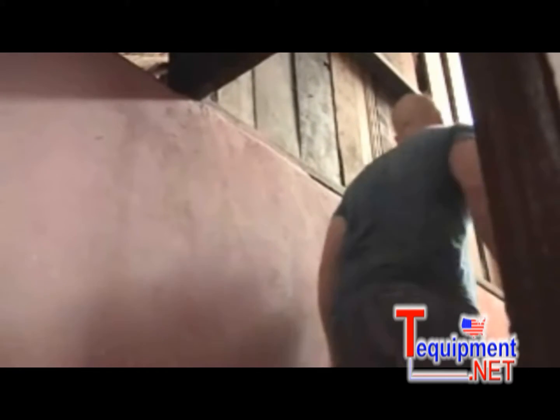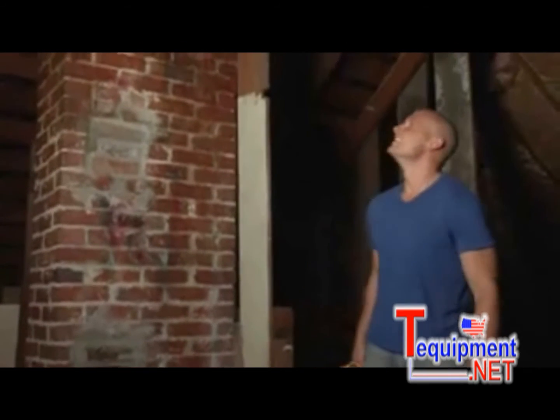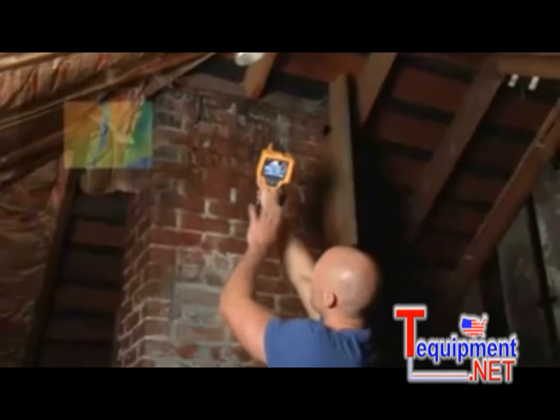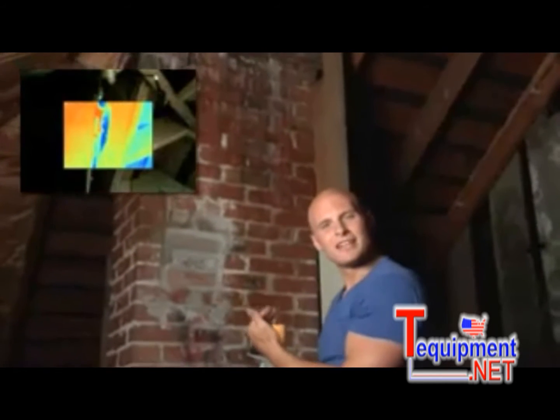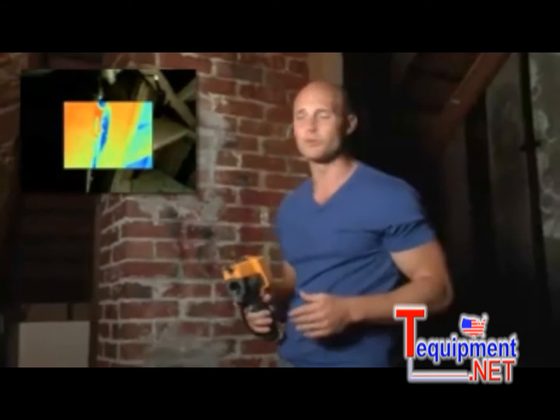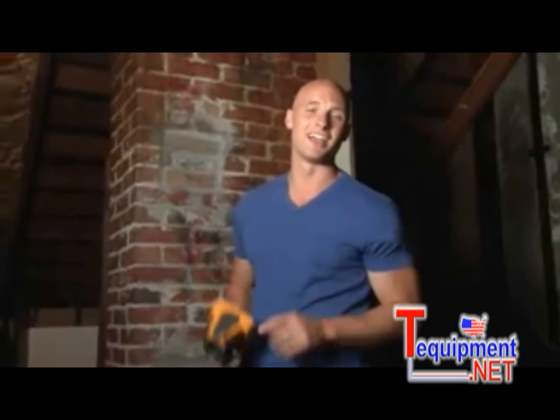Continuing to scan with water damage in mind, we're making our way up to the attic to check out the roof. Being in the Pacific Northwest, it's been raining here for the past few days, so any problems up here will be readily identifiable. And you see these dark spots? That's water that's come in through the roof, probably through misinstalled flashing, soaking these rafters. Over time, the water can come down the chimney, penetrating the ceiling below, causing real damage — and that's information any homeowner would pay to know.